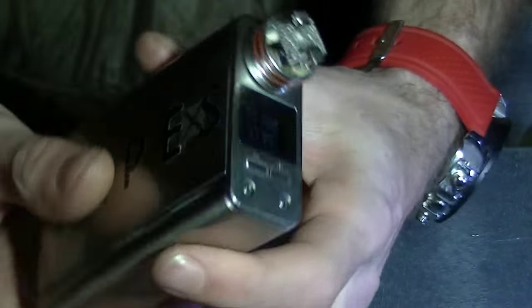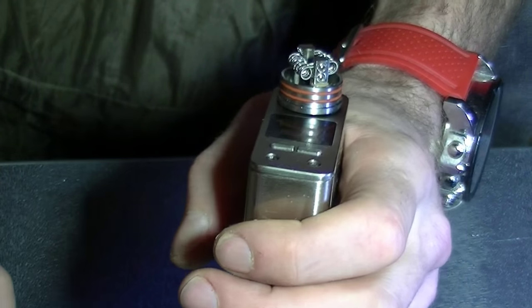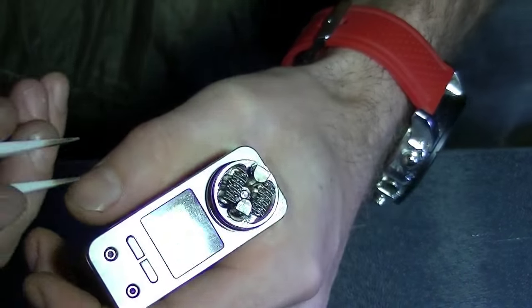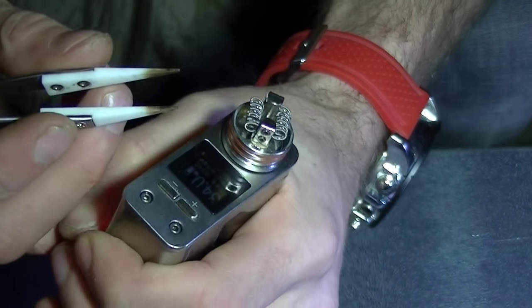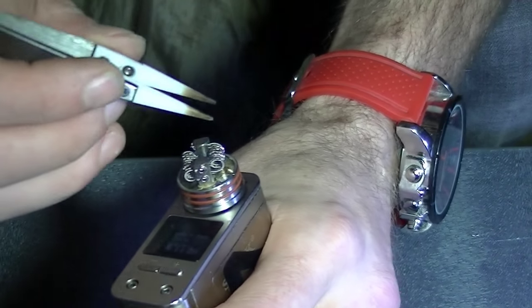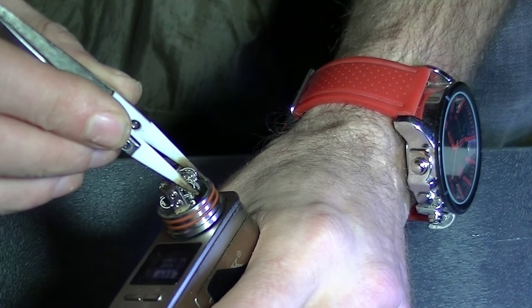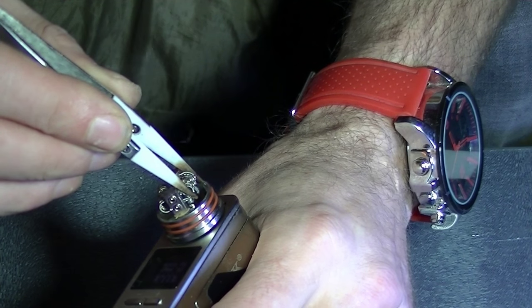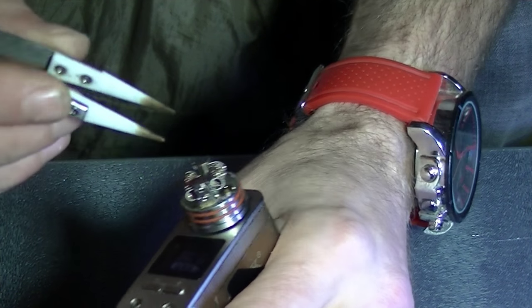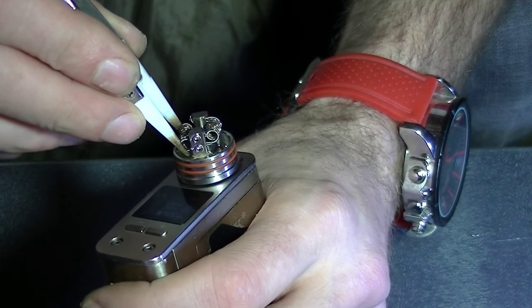You see, this one is not too low. This one registered at 0.23. And it will probably drop to 0.2 once I start fixing. So let's fix it. And always start at a pretty low wattage, just to make sure it doesn't go crazy. Right now I'm at 35 watts. And on top of it, you can see all those nice colors change.